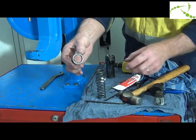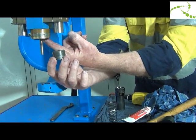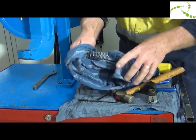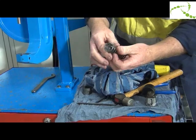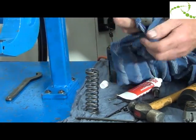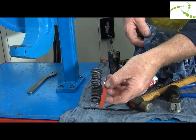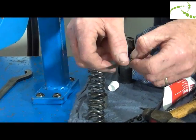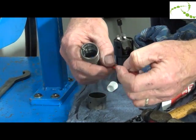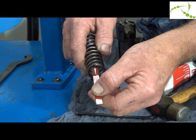There is a cup stop and an indexing spring — there are actually two cup stops, with another one sitting up inside. Give the spring a good clean, making sure there's no damage, it's not bent, and the tab is in place. Do the same with the cup stop — clean it off and make sure there are no burrs. This is a push rod — clean it off, make sure there are no burrs and it's not bent, and that the hole is in good condition. The push rod locates on the tab when reassembling, and it must stay on that tab. We'll fit all this back up now.